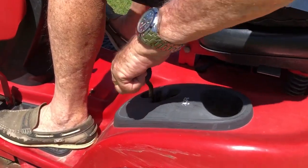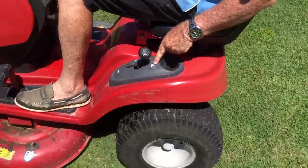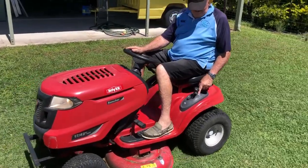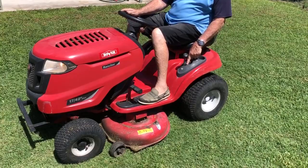There's your forward and reverse lever. If you want to go backwards, you go into reverse. By the way, you can't do that with the mower blades going — if you do that with the blades going, the safety switches will cut your blades off and stop them from spinning. You'll then have to push the clutch in and pull it back up again.